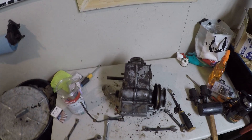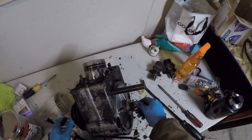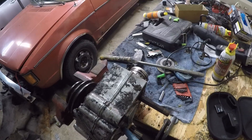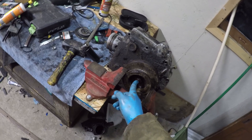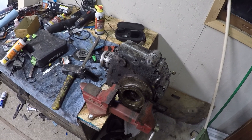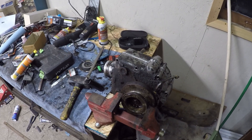We're missing something — let's figure out what it is. It looks like there's this big brass bearing right here which is slowly coming out, but I just don't think it wants to. It looks like a plug or something was threaded into this brass bearing and that's the last thing holding it in. Someone used this nut to try to start it, and I don't think we're going to be getting that off no matter what. I just don't have anything beefy enough to hold it to put the necessary torque on it, and a rattle gun would just round it right off. So we're going to drill out the bearing and see if we can't peel it off then.